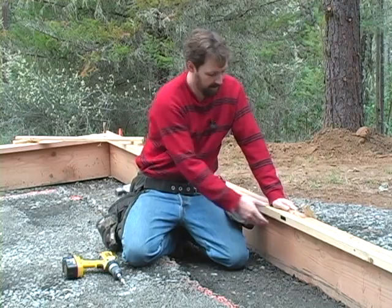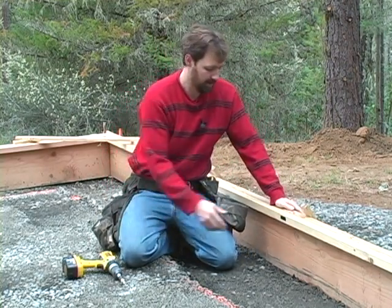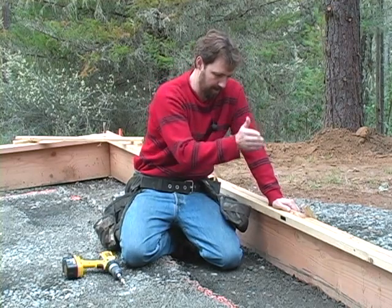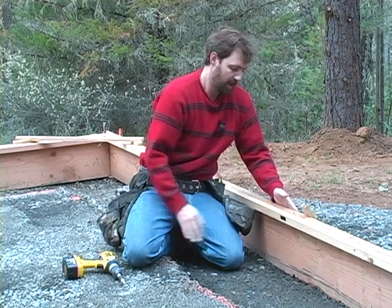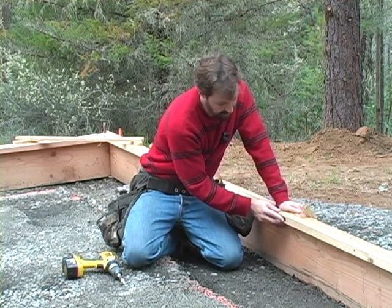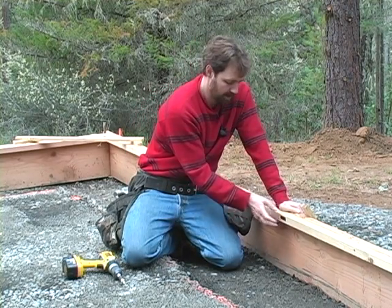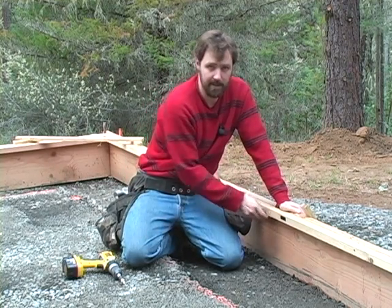With the form board straightened, I've put a plaster relief on the inside. We're doing a straw bale wall with an inch and a half of plaster on the outside. I want a detail in the foundation where the concrete comes down, moves out, and goes down to the outside so the plaster can come right down and line up close to flush with the outside of the concrete. I've used a two-by-two screwed in about every two feet at the top edge of the form, with a little piece of electrical tape over the screws to keep concrete out of the threads so I can remove and reuse them.